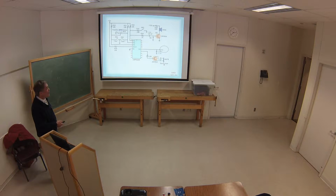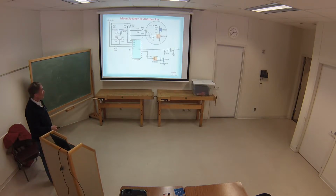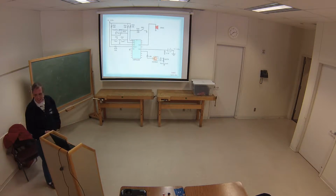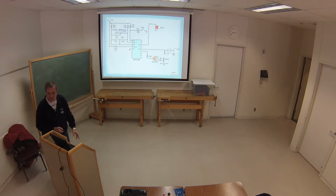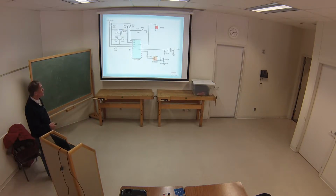Changed the battery from a 12 volt to a 5 volt, and hooked it in there directly. I simplified the speaker circuit. Instead of driving a transistor to switch it, I just ran it right to the speaker through a resistor, and then I got rid of the resistor. So it's about as simple as you can get. I turn on and off the pin. That shoves current to the speaker. You turn it on and off, and it makes a tone. Very, very simple, but for the application that we're talking about, it works just fine. So we got rid of a whole lot of circuitry that they don't have to put on the first little keyer board.